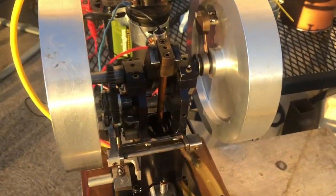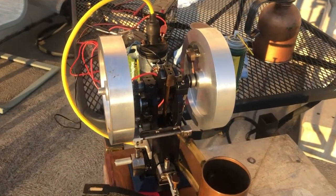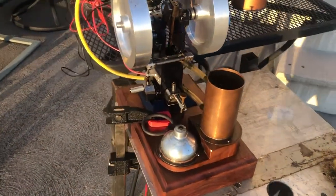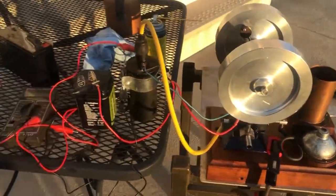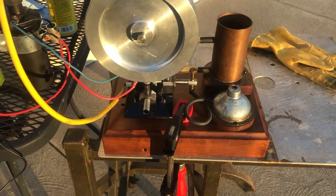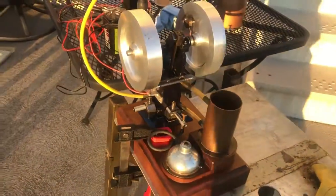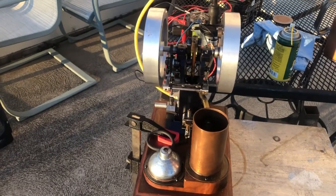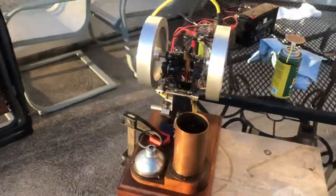I'm just running it on Coleman fuel with a tiny little bit of two-cycle oil in it. I believe the connecting rod is not per his plans — I've seen other ones that don't have connecting rods like this one, but it seems to work fine. I haven't set up a real good ignition system yet; I just have it kind of cobbled together with a battery and a coil. It's been hollowed out under the base for an ignition coil, but it was missing when I got it and I haven't put anything together to make it a single self-contained unit yet. It is a nice running engine though — we'll fire it up.